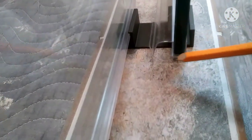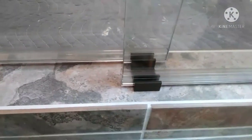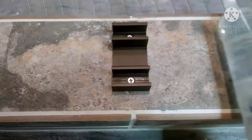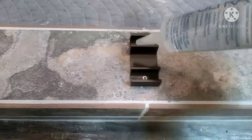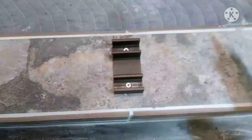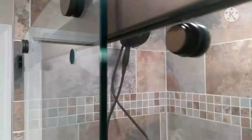Put your door sweeps on the bottom — those just wedge onto the glass, but you have to cut them to fit. Then slide the bottom bracket on, locate it side to side and in and out, make a couple of light pencil reference marks, and drill the holes. After drilling, load up those holes and the little sleeves with silicone, then silicone around it. Don't spare any silicone putting these down — I don't like drilling through the curb, but this thing is pretty waterproof.